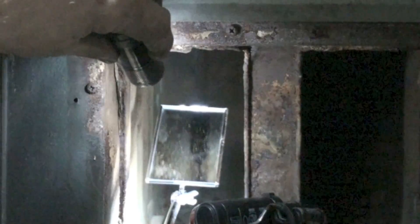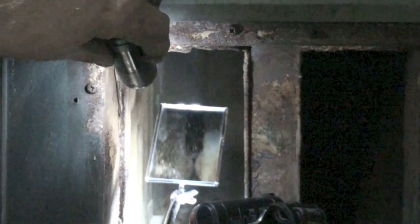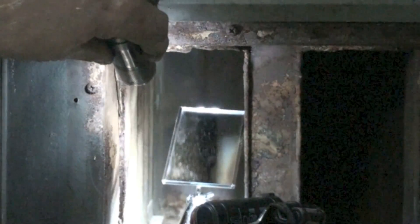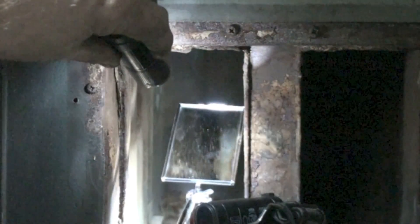Do this on all the tubes and take whatever time it takes. Get your burners out first, because it doesn't work well unless you do — get those out of there. You can do it without removing them, but it's a pain, and you've got to clean them anyway. So that's how to check that heat exchanger with your mirror.